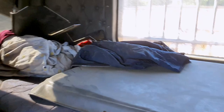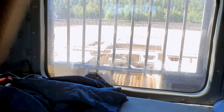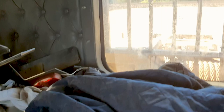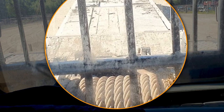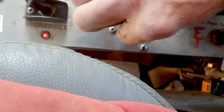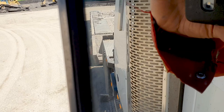Did it get disconnected? Okay, so brake is off the truck. I pull ahead a bit here. We come away from the trailer. Now the cable's loose, and PTO is live to the clutch. Okay, now we undog the winch, pull ahead. Now the winch is freewheeling.